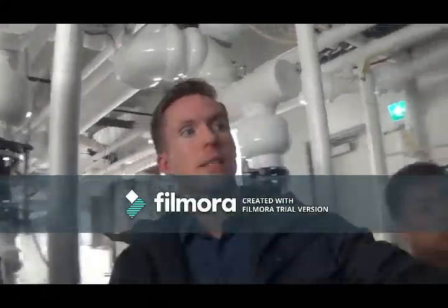By looking at this, from a quick look, the biggest things that I look for are delta T and high fire, the difference between inlet and outlet temperature. That's really important to me. High flow, or the specific flow for these boilers, is paramount for longevity. But we'll see that in the startup report. So this is not a preset thing? This is not how it's coming from the manufacturer?